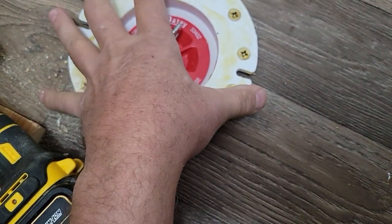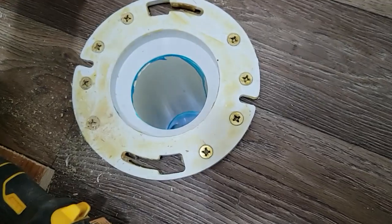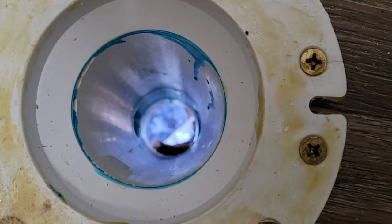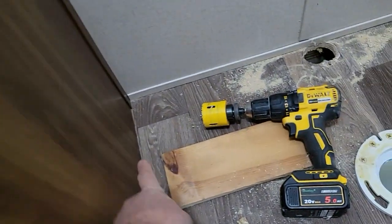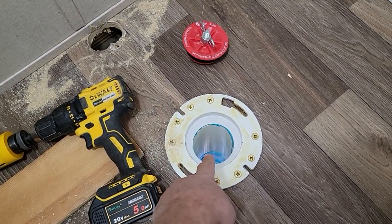And I'm going to leave this flange in place because inside my flange, all the drains go into this one outlet. So I got a drain from the shower and a drain from this vanity here and the sink. They all drain into there. I don't know if you can see off to the side, there's a hole there and there's a hole there. So one comes from each side. So then you'll have to also map out your plumbing runs. So the vanity drain comes straight through here, then it elbows and goes into the side there.